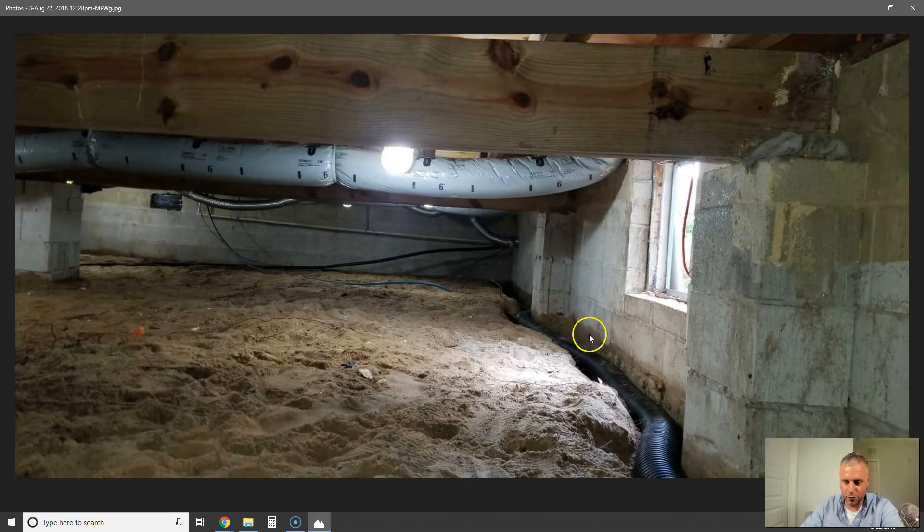You can see here's where you come into the crawl space. If we put in an access — one of our custom accesses — we'll actually drill down and have a pipe that ties right into here to drain the access well, so it doesn't flood over the crawl space door. Then it gets into the drain tile pipe and is taken to the sump pump to be pumped far away from the foundation.